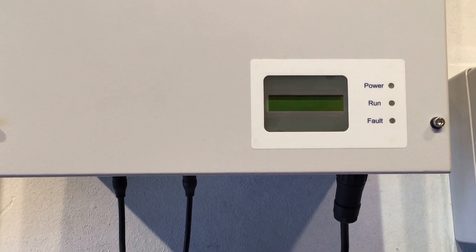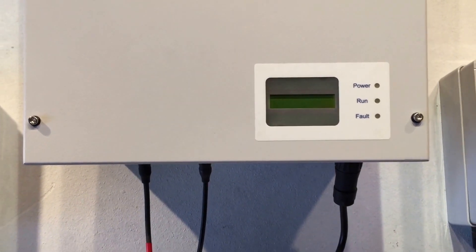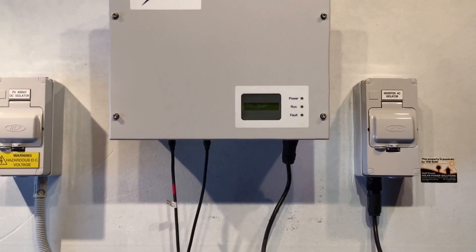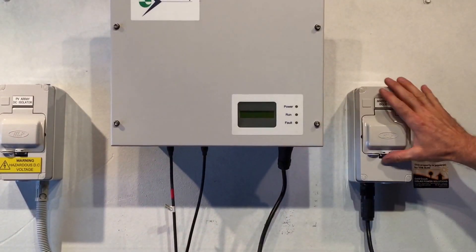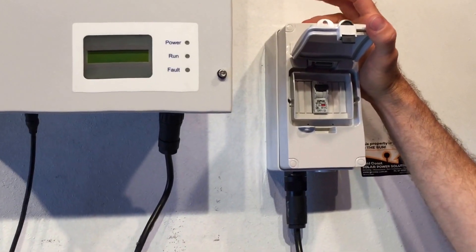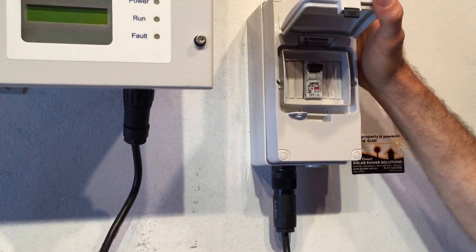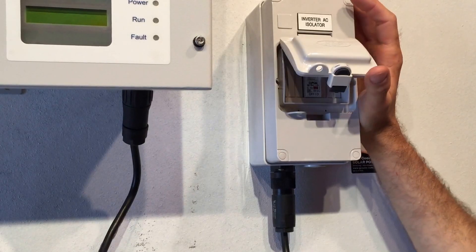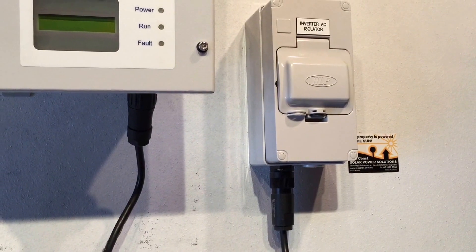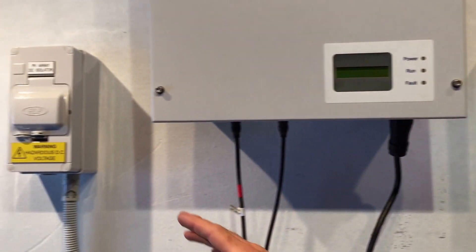In this case we've got nothing on at all. So if your AeroSharp inverter is doing this type of thing, the first thing to do is check that everything is on. Here on the right hand side we've got our inverter AC isolator, so we just check that's definitely on. If your inverter is beside your switchboard you may not have an inverter AC isolator — you might just have a solar supply main switch in the switchboard. So you just need to check that's turned on, and if that's all on, then we need to check the PVDC DC isolator.